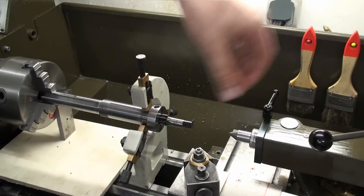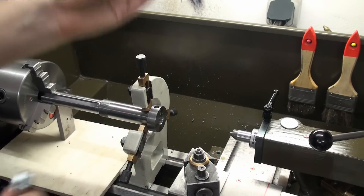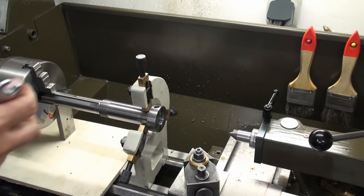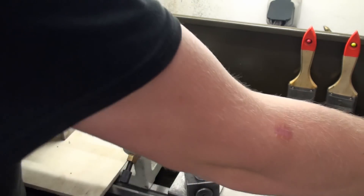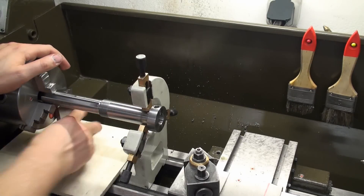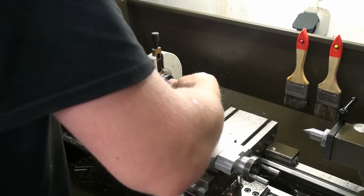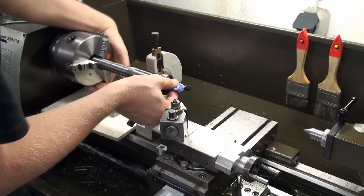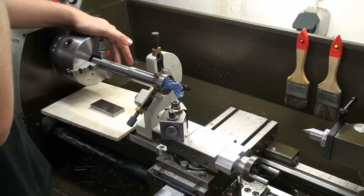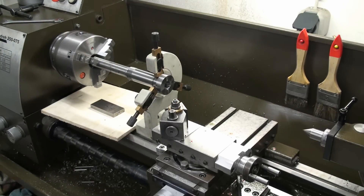Let's take this out. We made some chips — we're really only shaving off the absolute high spots, so we get a nice smooth bore. That feels pretty good. Now we clean out the taper, first with a shop towel. Don't do this under power — this will catch you and tear off your fingers. You really don't want that to happen.